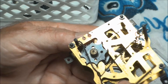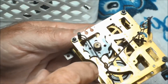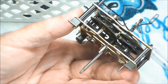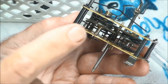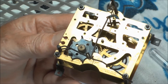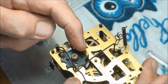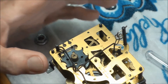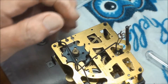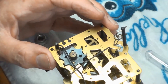Now we need to take these four nuts off and we can separate the frame. Carefully take it apart — get a picture looking straight down onto the movement to see what the gears look like. It's still good to get pictures from the side so you can refer to those if there's something hidden in the photo. Take the last nut off, and because we couldn't get the winding gear off, it'll also come off as we slide it out — the pendulum part.